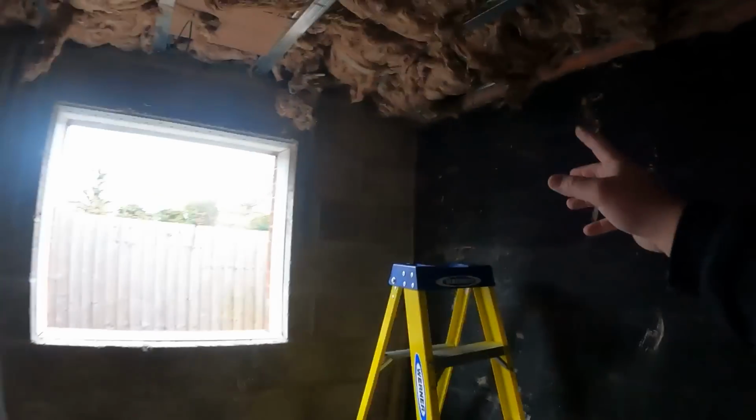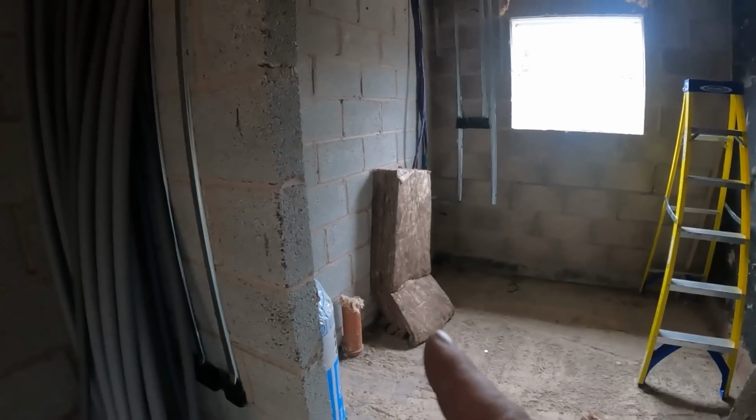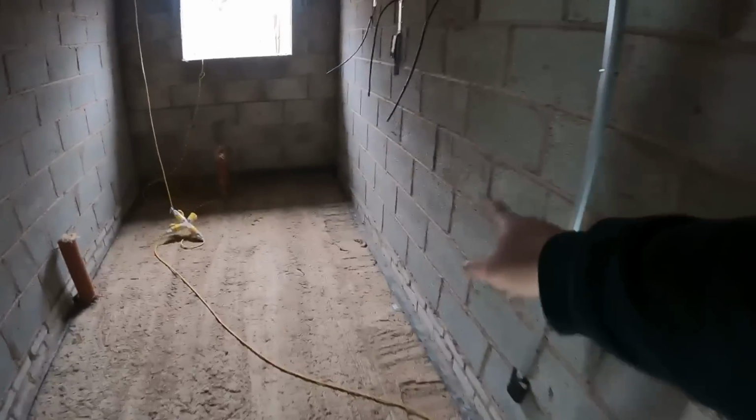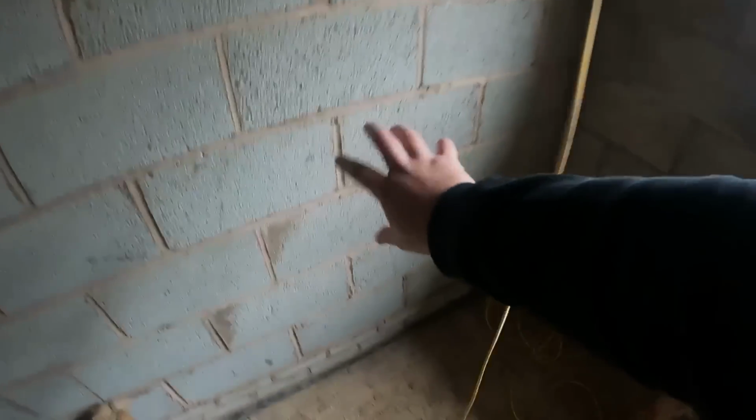We're going to bring two 22 mil hot and colds down here into the boiler room that are then going to go from there through the roof space and pick up. Sink units are going to go in there, so we can drop in that corner. And then we're going to come through the back of here to feed a basin unit, a twin basin that's going here. This wall's being studded off, so we're going to bring hot and colds along here to the shower valves going here with the filler here.